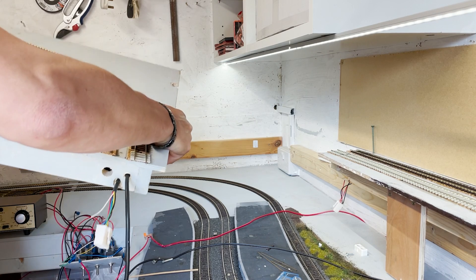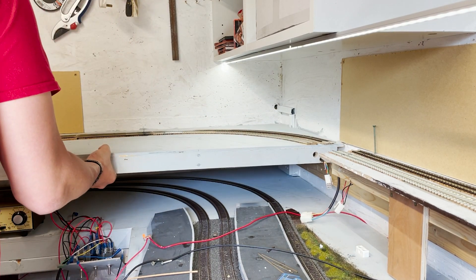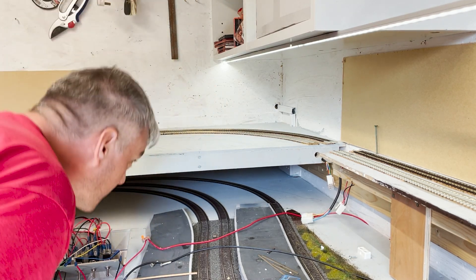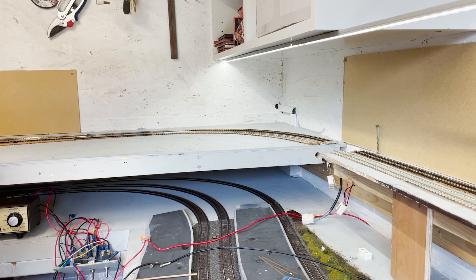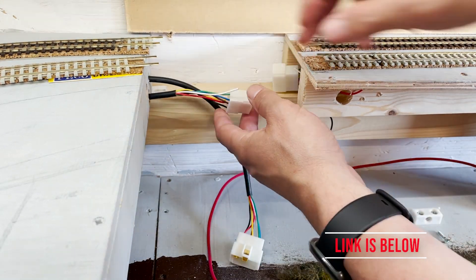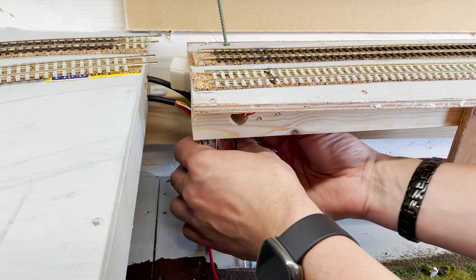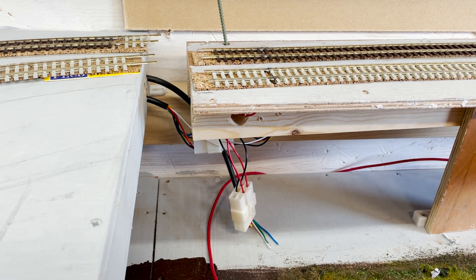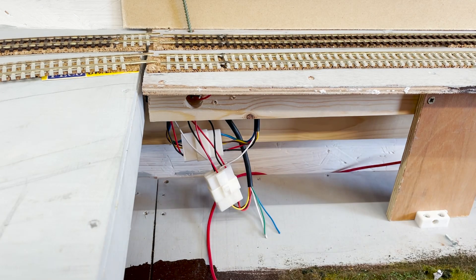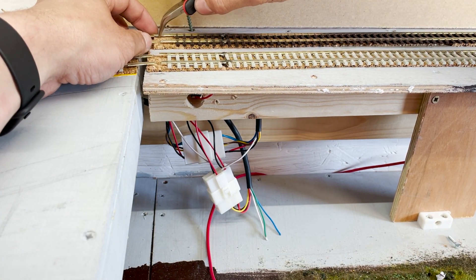In a magic thing that's happened, I've now put in a completely separate bit of track. With this, I wanted to show how I'm connecting the baseboards, because I'm making this so that when I move house one day I can take it all out without too much destruction and move it to another location. So at the edge of each baseboard I've put some six-pin plugs — got them off Amazon, dirt cheap. They're not the best quality in the world, but they've got uninsulated crimp terminals that just push in. They're perfect for this. Now just slide that bit of track in. You can apply this if you were doing shows or whatever — you might use a better quality plug, but essentially that's what we're doing.